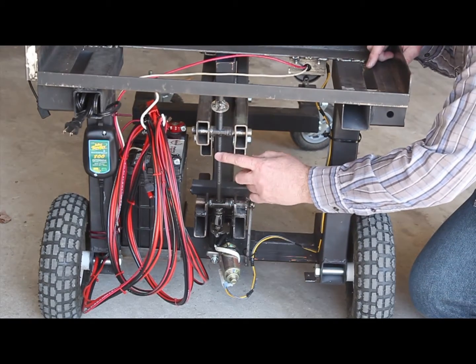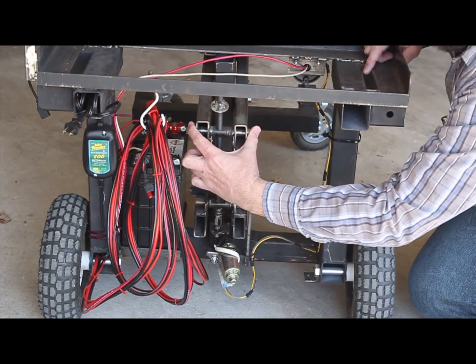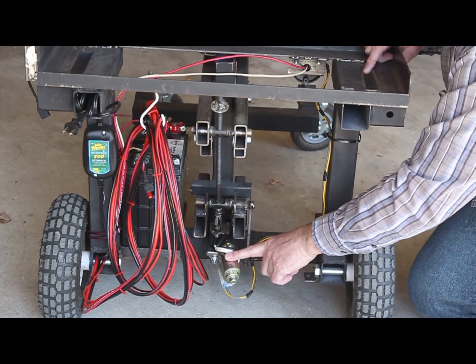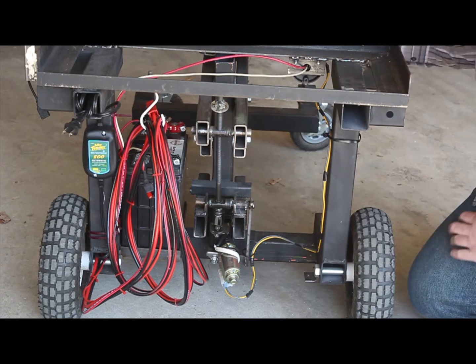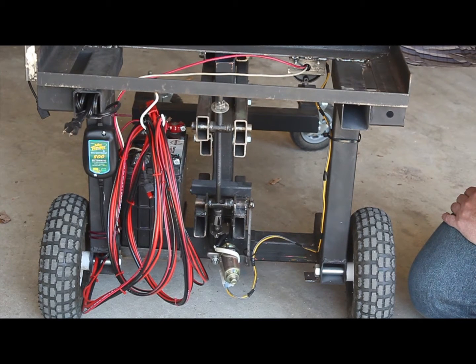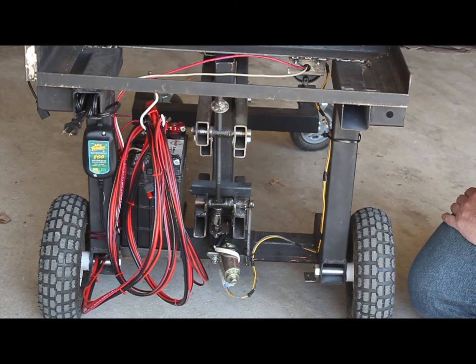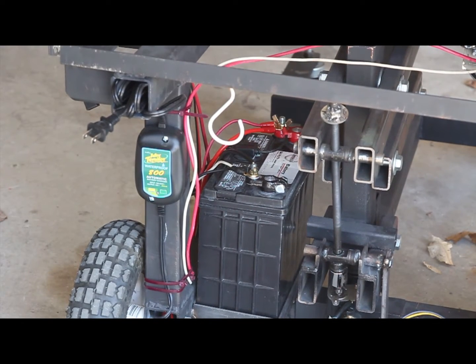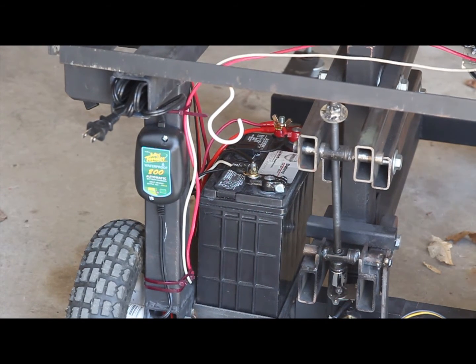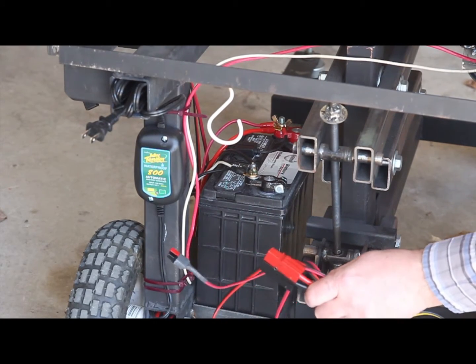This is the screw — it came from an automotive jack. It's on a pivot here and here. It's an electric seat motor. All it does is turn the screw, which pulls this arm down, which raises the whole telescope. I have a small automotive battery hooked up back to the switch and back to the motor. It also comes out on this cord right here, and this is what goes to the telescope and powers it. Everything gets powered through this connector right here.